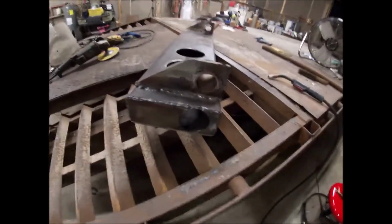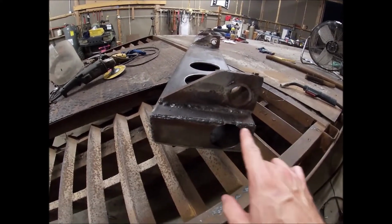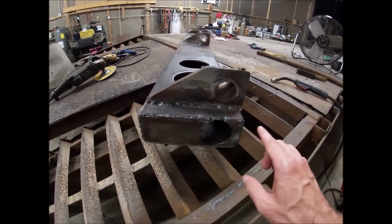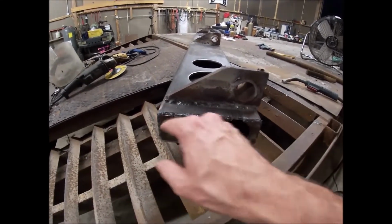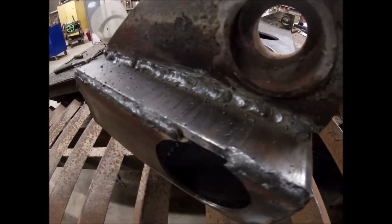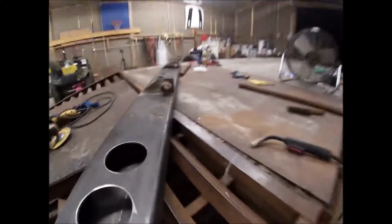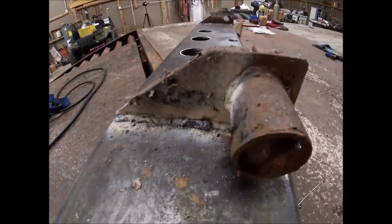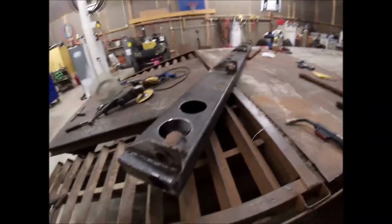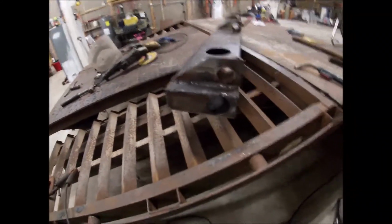All right, guys, quick show of the welds, what everything's looking like. I did make this a two-passer where I run basically straight into the tube to build up, sort of cover the gap. And then I run back across that weld bead a second pass to knit it in. My other welds, they don't look that great. This is the last weld I've done. That weld, I haven't even cleaned the slag off of it, but I started down on the far end, worked my way down here. Welding, again, practice makes perfect. The more you weld, the better you get.